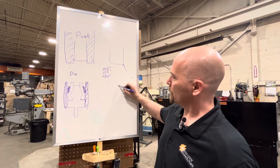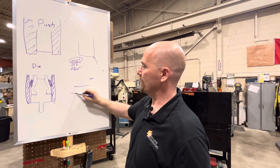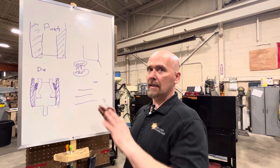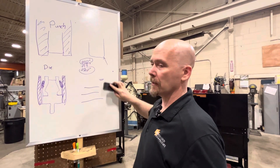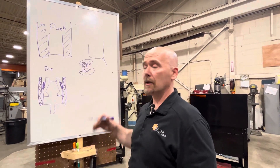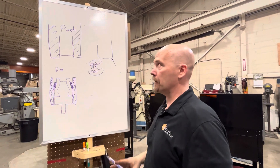Where does the punch tip radius matter? If you've got very thin material, you're going to want something closer to a 10, and if you've got very thick material or soft material, you're going to want a 20. A good middle ground is the 15 — it handles a lot of different materials. For common sheet metal shops, the 15 gets a lot done, but whenever you run into problems you can go up or down on that punch tip radius ladder to help get a better result.